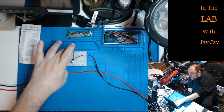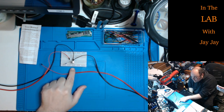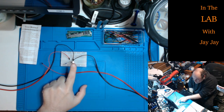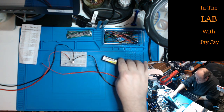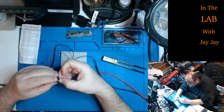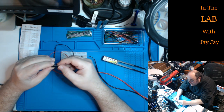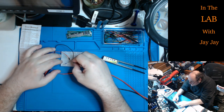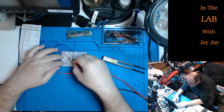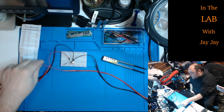I've put together a little test circuit here. This is a 25 volt, 330, actually, let me just pop it out and I'll tell you. 25 volt, 330 microfarad capacitor. It's electrolytic, so it's polarized, so we make sure we put it in the right way around.